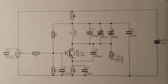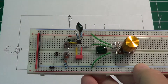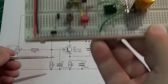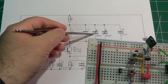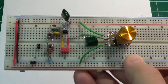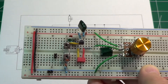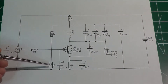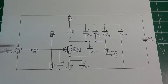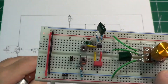Let's now take a look at the implementation of this oscillator. The circuit is already built on this breadboard. You can see the transistor here, and then the resonation tank over here — L1, a capacitor, and two variable capacitors. This is inductor L1, and then the capacitor and the two variable capacitors. The polarization circuit includes a 150K resistor, 33K resistor, another resistor, the potentiometer, and a capacitor — all connected to the base.